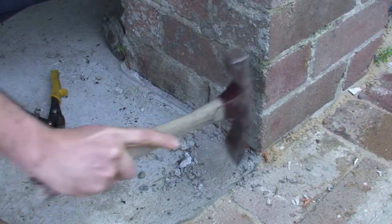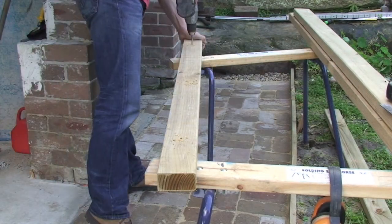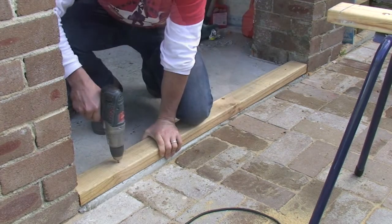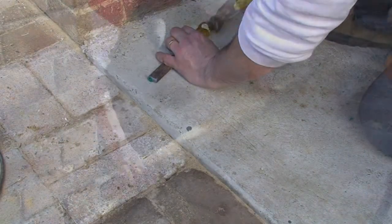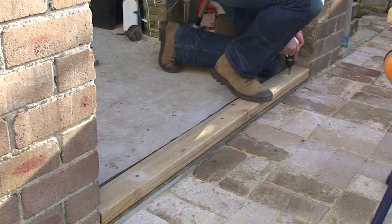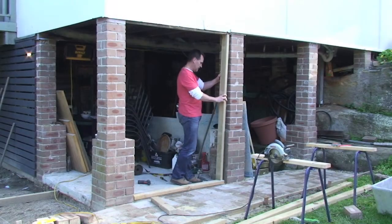I'm just tidying up the corners of my concrete slab before my base plate goes down. A trick with the plate going onto the slab is to pre-drill it — that way you can fit it in place and drill through with a masonry bit, mark where you need to drill your holes, hammer in your plugs, cut the tops off, fit your plate, and screw down. You'll notice I flash the base plate too.